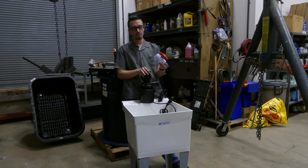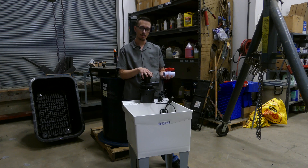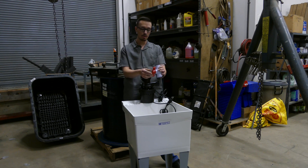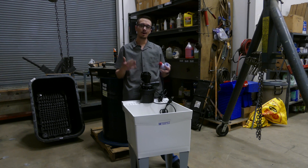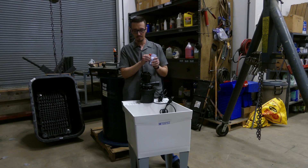That's why it's handy that it includes this ball valve. Once you get this installed on the bottom of the sink, you can incorporate this ball valve into the discharge and have it partially closed. You can adjust it to match your incoming flow of water and keep the pump running so it's not cycling on and off as you're using the sink. Very handy that it comes with this.